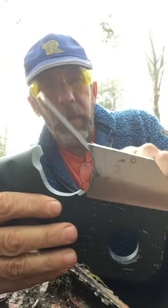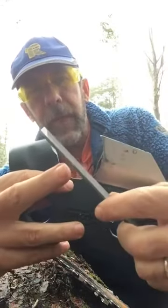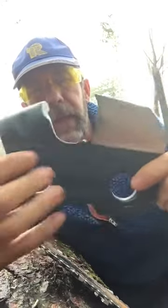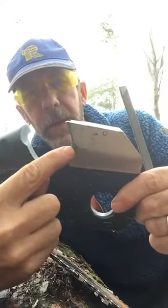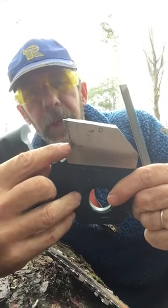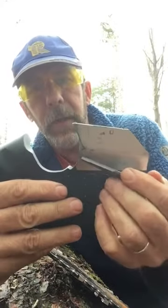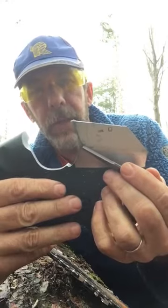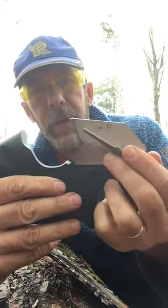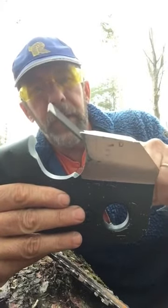When that happens, go back to the model. I know it's not proportional but you'll get the idea. When you're filing and you lose that corner of your file, it stops cutting steel right there. And once that file stops getting rid of that steel, as you go across, each stroke of your file starts to incrementally file upward. You won't be getting rid of that steel. So as your file starts to walk up, it's going to start to walk up here. That's the problem — trying to keep your file clean and in good shape so that it stays down in where it's supposed to be.